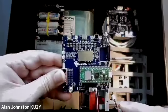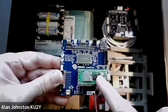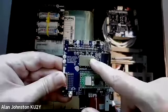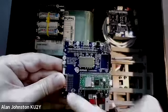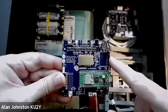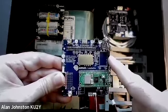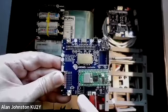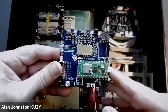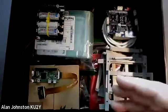This is the STEM payload board. It's got the Raspberry Pi Pico already programmed, and it's got the FM transceiver. It's got the SMA coax ready for the antennas, and it's got sockets for the two sensors — the MPU6050 and the BME280 — which for this kit you will need to solder. But the board itself is ready to go and has the JST connector.